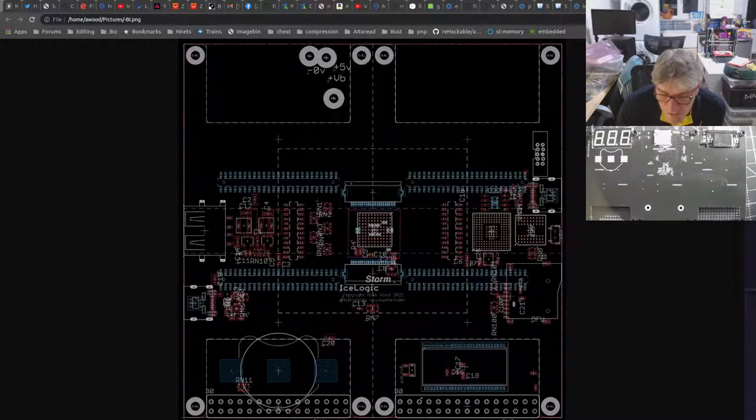It comes with a VGA and 7-segment standard. It has a new 16-bit PSRAM and flash. The SDRAM has moved to the STM32 and is larger. It has fewer Mix Mods and PMods. Although you could replace the mezzanine with a HyperFlash and the top thing, and have two lots of PMods, in which case you'd have two big Mix Mods and two PMods. So it would be very similar to the original, or to the current BlackIce, if you wanted to go that route.